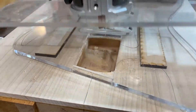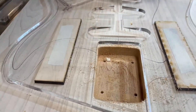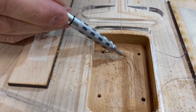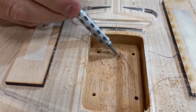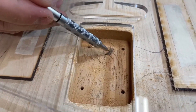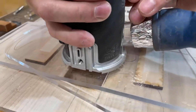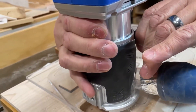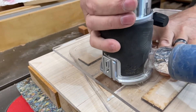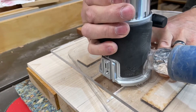Now once this is stopped, I can inspect the pocket. You can see the route I just did is a little higher than my five-eighths depth, because this is the five-eighths deep that my Forstner bit cut. So now all I need to do is drop my bit down just this last little bit. I'll put my router in, release the mechanism on it, and drop it down to where I just feel that blade engage the surface of the mortise cut that my Forstner bit made.